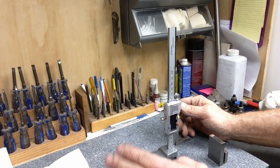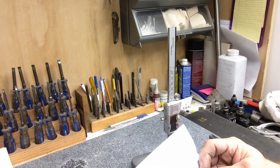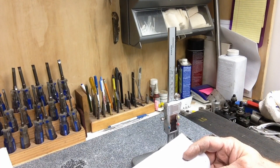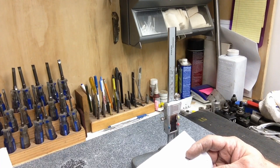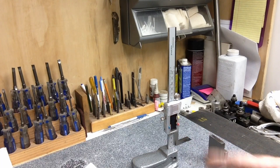One of the things I did notice that you never used to see on any of the other calipers or electronic Chinese scales is it actually gives your data output information — tells you what your pin positioning is for your four connections, gives you your binary code which is 24-bit, cycles, and clock pulses. You never used to have any of that information. The guys that were real electronics whizzes were able to figure that out and publish it, but it never came with the equipment. I kind of like that — we'll be able to do something with this, maybe.